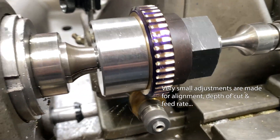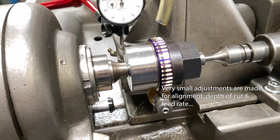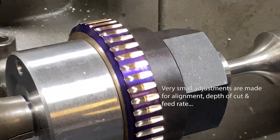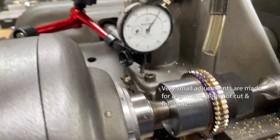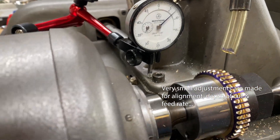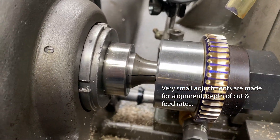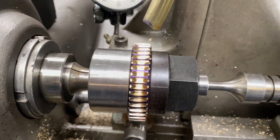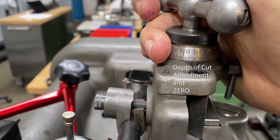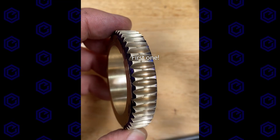From here on out we only need to make really small adjustments. So we cut, we inspect, we change, we alter, we cut, we inspect — and then we get right down to the brass tacks on exactly where the machine is set up so it'll make this gear. This might seem like a lot of trouble, but the process doesn't take too long. The cut time for each one of these gears was just a few minutes, so it's definitely something you'd prefer to make a hundred of in your shop, or at least 20 or so.